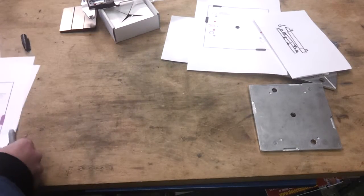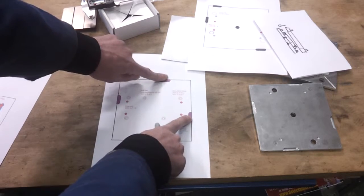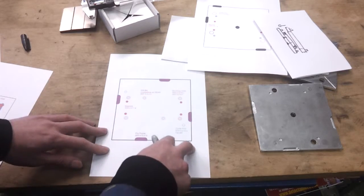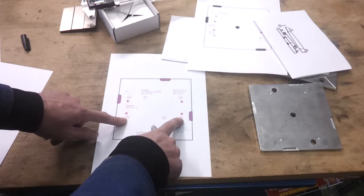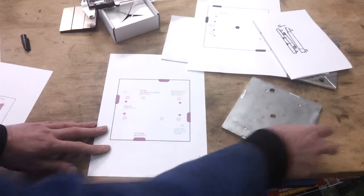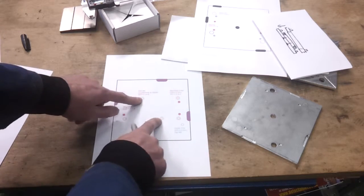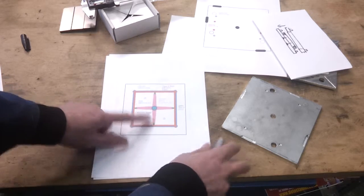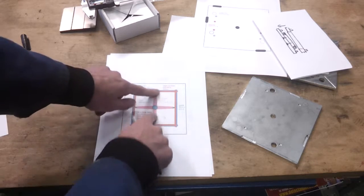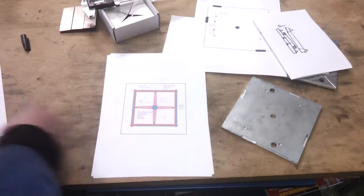Looking at the design files: this is going to be the bottom sheet. I'll have some little cutaways on the edge so I can get a screwdriver and pry the mould apart when it's cooled and contracted. There are some mounting hole points standard for the mould base, a couple of 5mm holes for guide pins using cap screws, and holes from the back to secure it. I need to pocket out a runner on the front to get the plastic into the frame, and I'm going to do this in quadrants so I'm not trying to flow all the way around and get weak weld lines — some little gates should do the job.